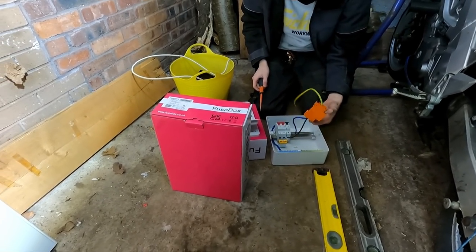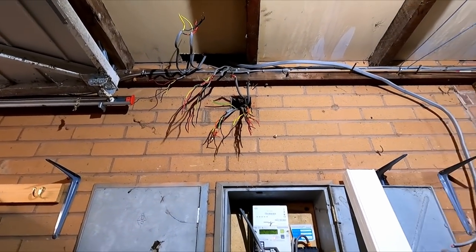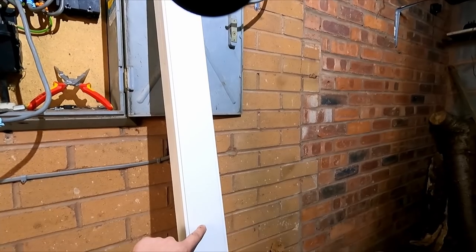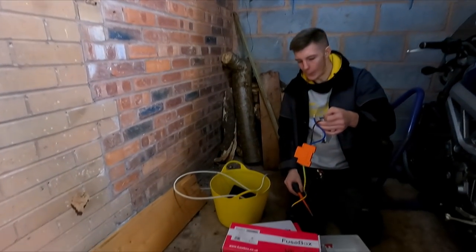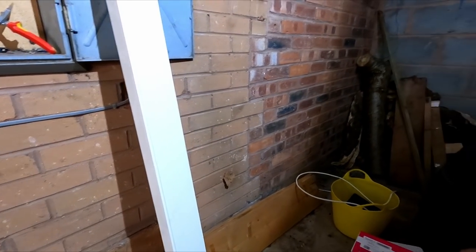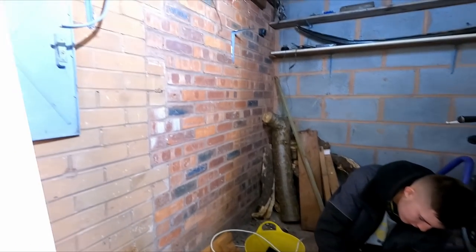We're both going to do... I'm doing rear entry in my board, or equally top entry, because we've got cables coming from multiple angles. I'm just going to drop it down, get a bit of 4x2 trunking here, knock out the top, fire grommet at the top, and then he'll be able to literally go straight in, straight out. He should be done quite quickly. There's only 3 cables for him to do. I'm going to run the new 6mm. Got some patches though, haven't I? Yeah, I didn't have any patches on the van, some malleable ones.